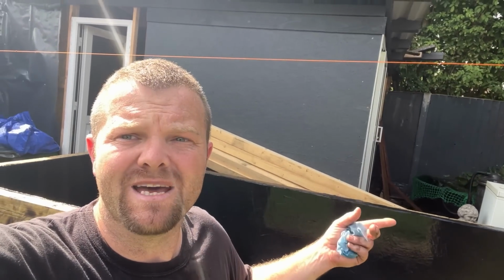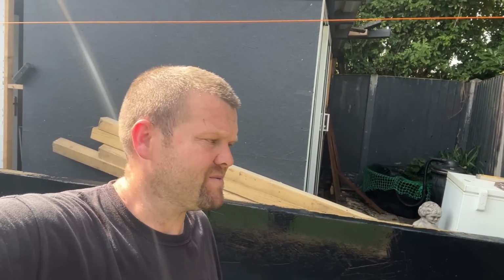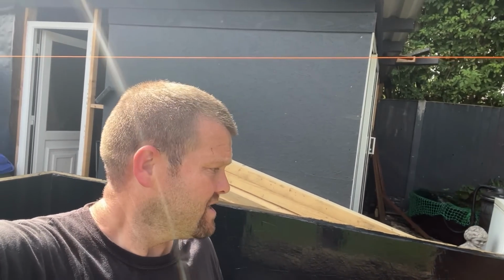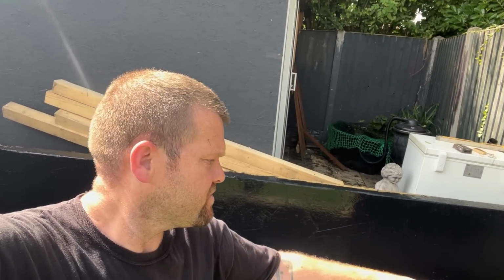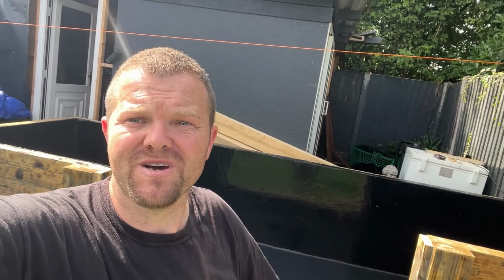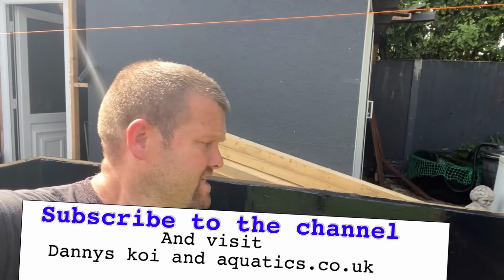I wanted to get here a bit early this morning for 6:30, but obviously I was looking for my sausage gun this morning. I could not find it anywhere, but obviously it was in the van, found it in the end, so I got here a bit late, an hour or so late. But it's done now, well happy, but I would not do it in the sun again, because it goes off too quick. In the corners and stuff, and down here, you can see where it starts to drag with the trowel, and that goes off a bit too quick. Literally 5 minutes, coming round, gone off dead quick, so I would not do it in the sun. But in the next couple of weeks, the sun will be gone, and winter's on its way. Autumn's here, so we're getting cold again, so you should be fine.